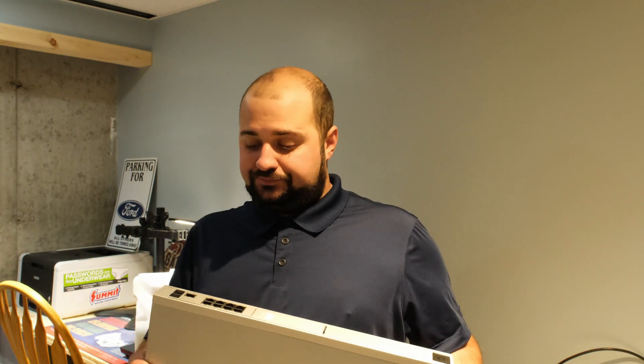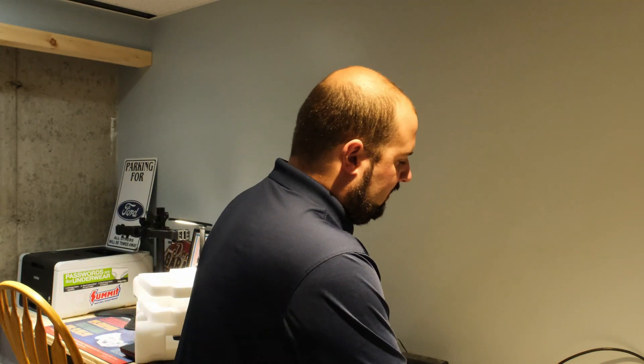This will act as the controller, so all of my UniFi equipment will talk to this. I also have a pair of Nano Station M5s shooting down my driveway to my barn, and those are getting a little long in the tooth — they're only 100 meg uplinks and I have a bunch of cameras on the lower property that are starting to saturate that link. My goal is to upgrade those to the UniFi building-to-building bridge system so I can see them in my UniFi console and have a whole picture of my network.